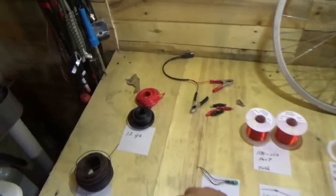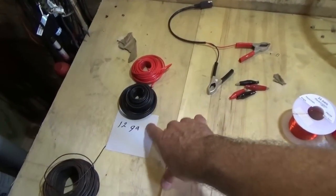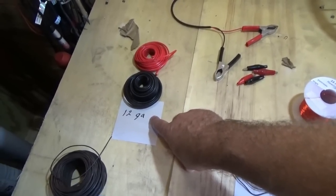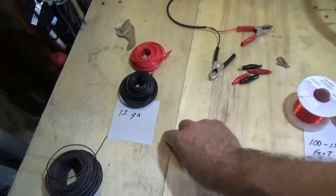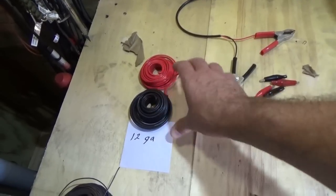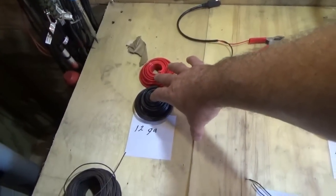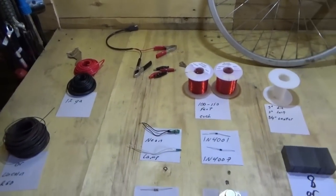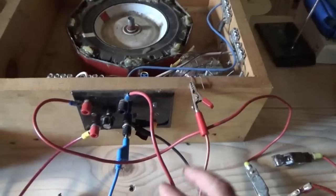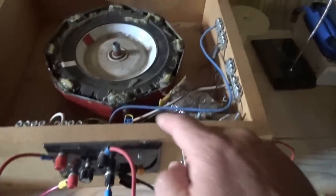Let's start in the top left corner — we need some connecting hookup wire, 12 gauge to 18 gauge, but definitely larger than 20 gauge wire. For those not familiar with wire gauges, the larger the number the smaller the wire; the smaller the number the thicker the wire. I prefer 12 gauge. I'll have links where you can purchase this. Here on my old Bedini motor you can see the connecting wire coming out of the circuit going to the batteries.